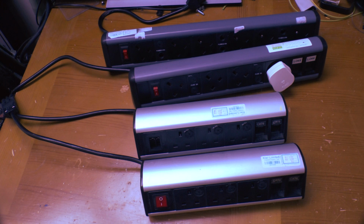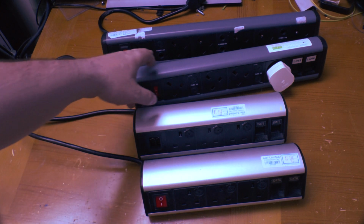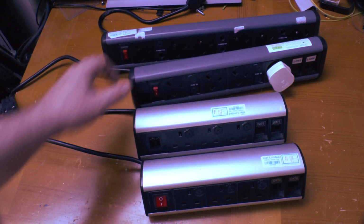They only seem to serve one purpose from what I've seen, especially on the 6-way ones where the fuses are only rated at 3.15 amps instead of 5. And that's to blow if you plug anything remotely high powered into the thing. I've seen these with blown fuses in meeting rooms where the biggest thing somebody may have plugged in would be a projector. Of course, people just leave these dead sockets for the caretaker or the PAT guys to find, or there's a pretty good chance the person testing it will just fail the thing instead of actually replacing the fuse.